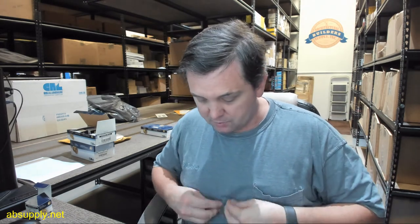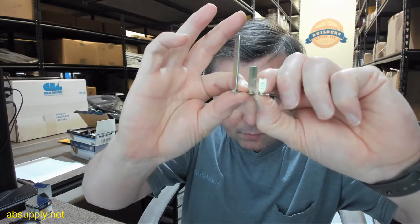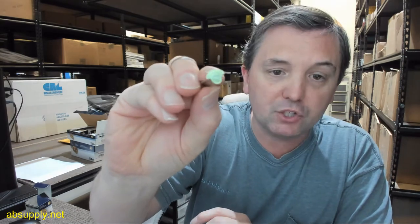The deadbolt style uses the same principle — it comes with three different length tail pieces. All of them are going to have that pie preparation for the lazy style action, meaning where you can take your key, throw the deadbolt, return the key back to vertical, and pull the key out without retracting the latch bolt. It's called a lazy style — lazy is literally the word that's used.